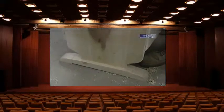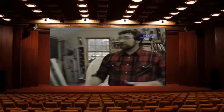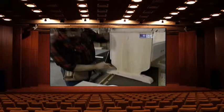The side is joined to the foot and the armrest with tenons. To cut the tenons, I'm going to use my radial arm saw with the dado head cutter as before. Now the bottom of each side piece is just curved a little bit. I've traced the outline from a little template that I made, and I'll cut it out on the bandsaw.